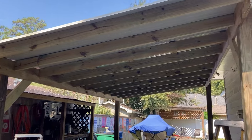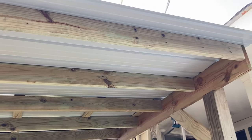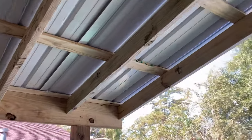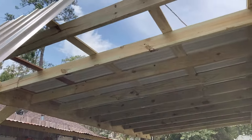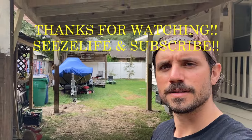I just finished putting all of the metal roofing up. I wanted to do a complete dry fit to see how the ends look, how they're matching up on both sides, and get a feel for the overhang. My purlin is going to need to come out about four inches when I make my final cuts. Everything looks pretty good overall — I'm very pleased with how it's going to look once it's all tacked down. The final piece is going up. We're nearing the end. The 12 by 20 lean-to carport that I built — an awesome project that took me about three days.